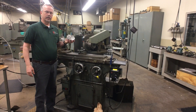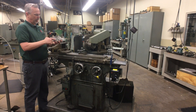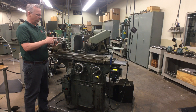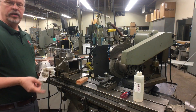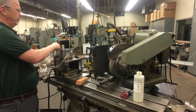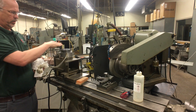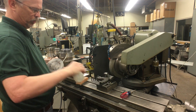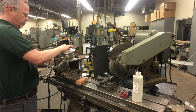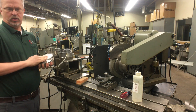I've got this part here. What I'm going to do is mount it up on this air bearing spindle and grind this part round, and we'll see just how round it can be. One of the unique features about this grinder is I have a tip-up fixture that I can tip up into position and load parts into, which makes dialing in parts easier — especially for thin wall parts.